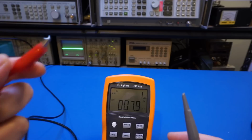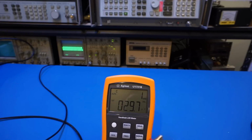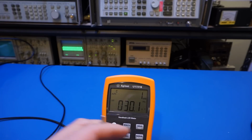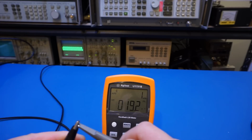which, remember, the signal wire is this red alligator clip here, and you can see that we have this periodic sinusoidal wave, which is very, very small in magnitude, which is our test signal that is applied to the device under test. And if I take a look at the shielding of the BNC, which is now connected to the guard terminal, you will see a similar signal waveform here.